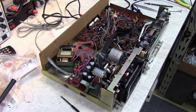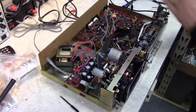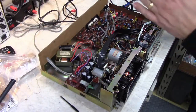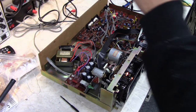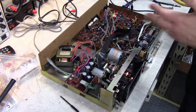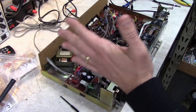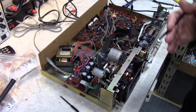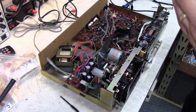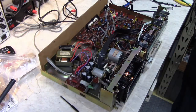And the meter is just kissing plus 3 dB. Okay, so I've gone back and forth several times with the playback equalization, the playback gain, and using the 10 kilohertz tape, the multi-tone tape, just trying to get the best average correct setting. With an auto reverse deck, when you flip the tape, you end up with a different result, so you just kind of have to split the difference between the two.